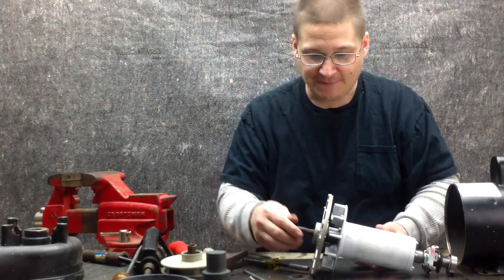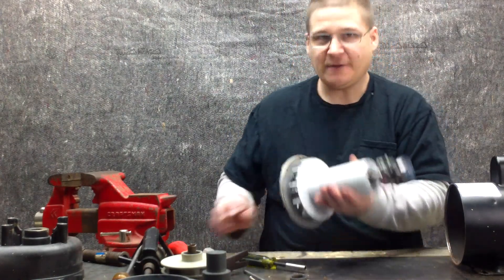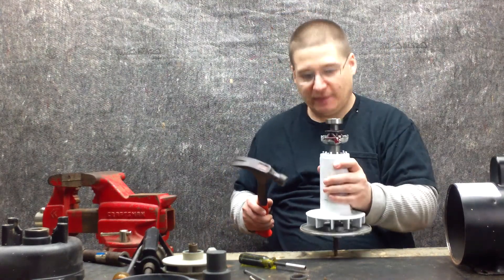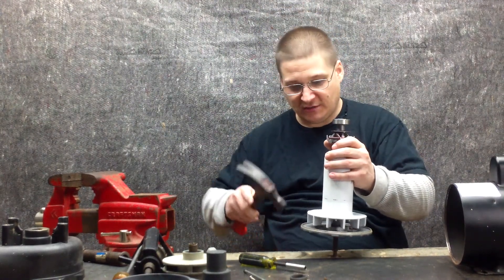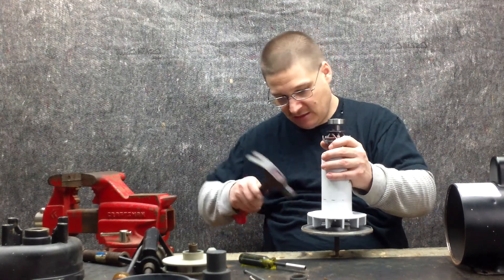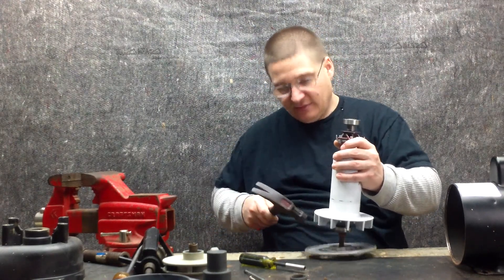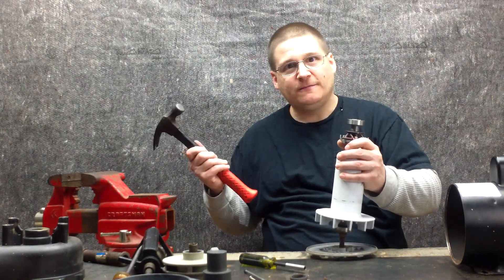So I'm going to move this little bearing tender. Now, what we have here is the front endbell's on there. What I'm going to do is take my endbell, point the shaft down to the wood, and just tap this endbell while I rotate it. Here we go. There you go, just like that.